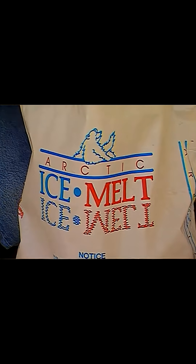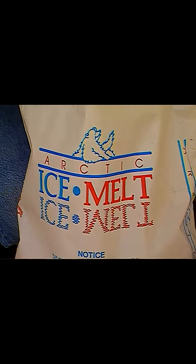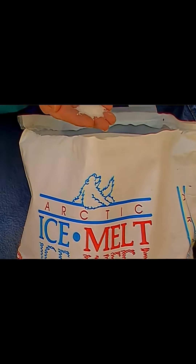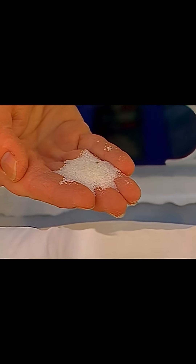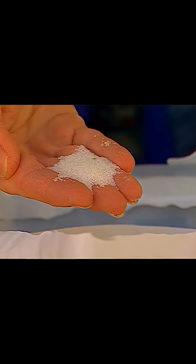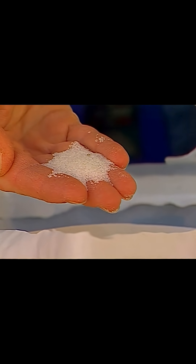There's another product available called ice melt, which is a calcium chloride solution. Although it's not as harmful to plants, it's very harmful to your driveway. If the concrete on your driveway or paving is less than two years old, or if it wasn't properly cured, this can actually scale away or exfoliate the surface of your concrete and chemically etch away the surface, and can be very damaging.